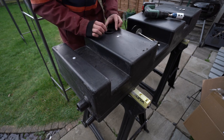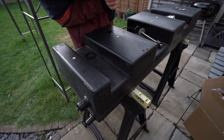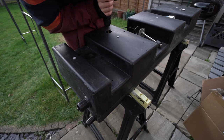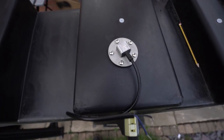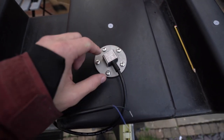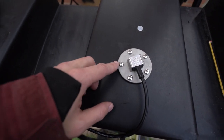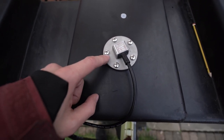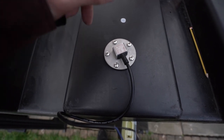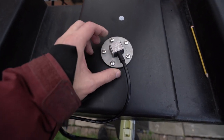Now we're going to drill out the screw holes. That's all mounted — it worked out perfectly. I used the bolts that came with it. I've seen some people just use self-tappers, but you can use the bolts that came with it — just drill a 4.5mm hole, then hand-screw it with a screwdriver and that threads the hole. These bolts seem to work perfectly fine.